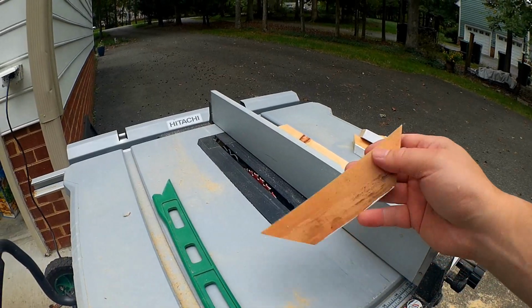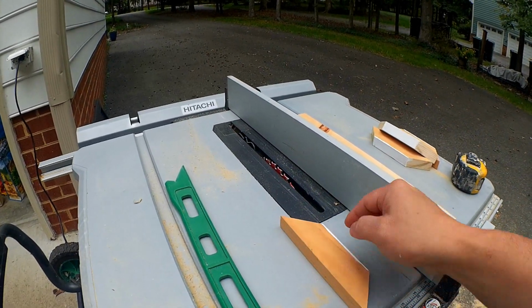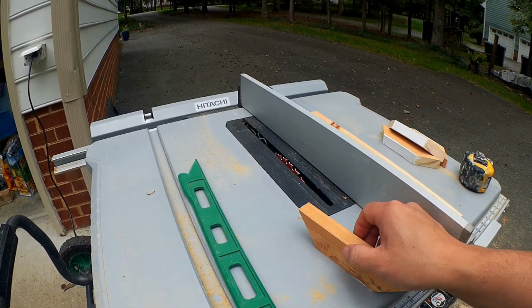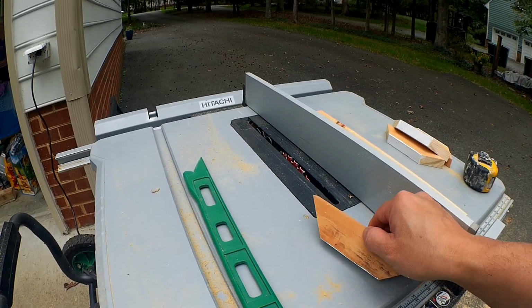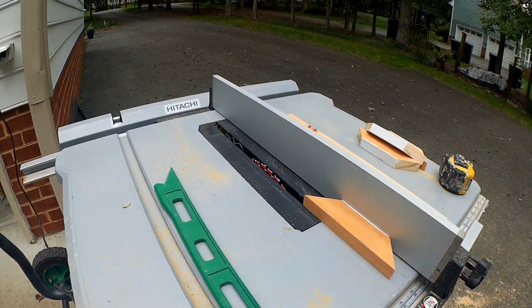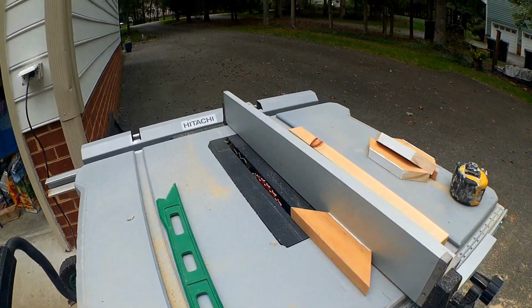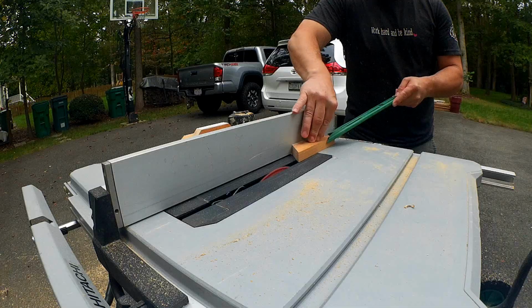With these pieces that are going to be surrounding the post, when it rains, the water comes down and it's gonna want to travel underneath here. So I want to put a little bit of a drip edge. I just have this raised up a little bit over 1/8 of an inch, and then just running this outer edge so that there's a little drip edge on these outer surrounds.